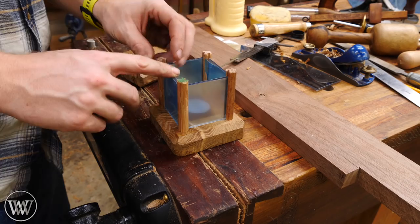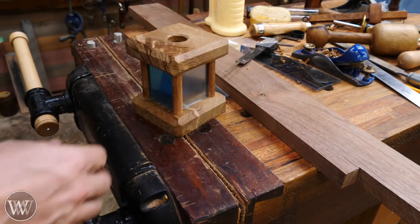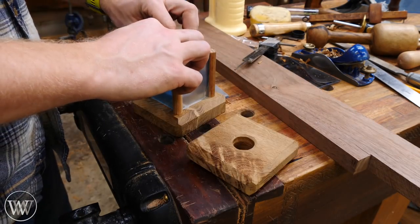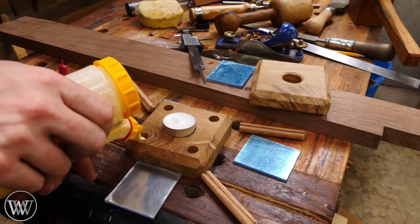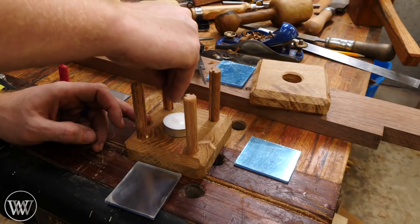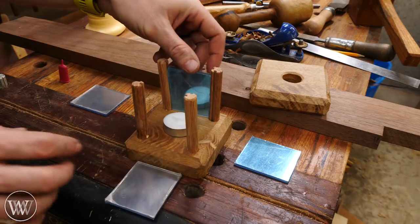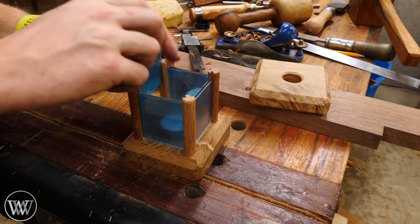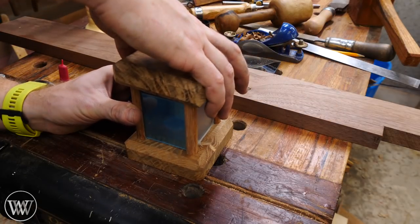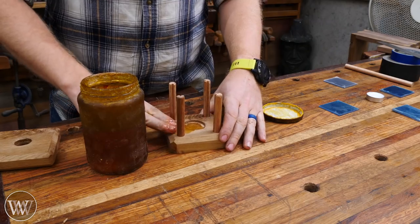So you can see I can get the tea light in, slide the last one in place, and then fit the top on. Now it is ready for glue up. I want to have all of the plexiglass in there for the glue up so that it holds everything in the right place, and the top holds the dowels in place. Put a little bit of glue into each of the bottom sockets, slide the dowels into place, and then slide the plexiglass down in. The plexiglass holds everything to the right dimension, and then the top goes on and holds all the dowels in place so they're not wobbling side to side. Then add a few clamps, let it sit for a while, and it's ready for finish.